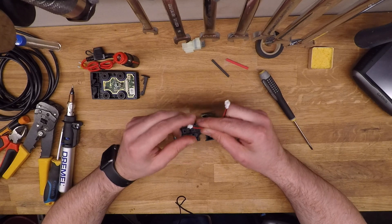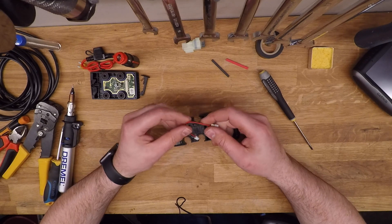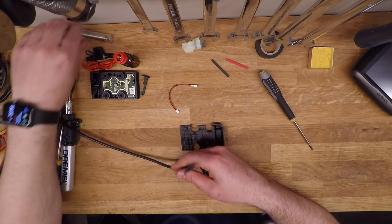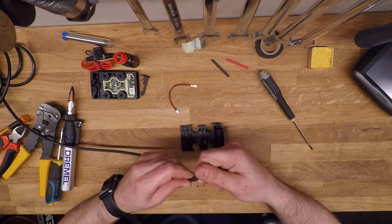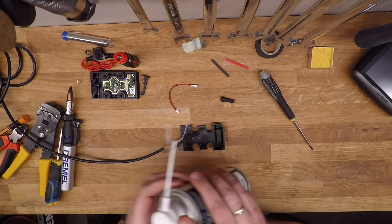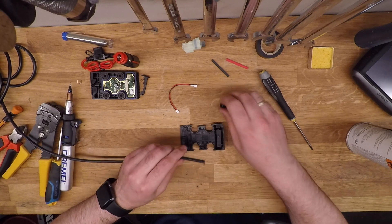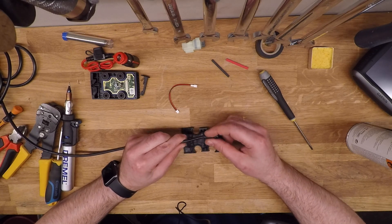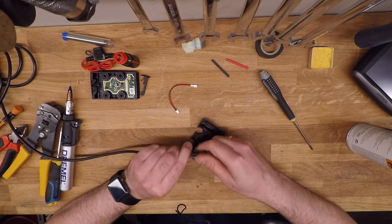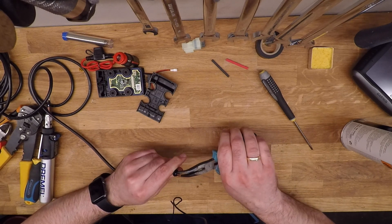If you have any residue of the silicone gasket, go ahead and peel that out. Next up you'll need a connector — I'll put a link in the description below. It's a fairly standard connector in the RC community so it shouldn't be too hard to get. Also have one of those flexible cable glands to put on the cable. In order to get the gland onto the cable, I have a 5mm very flexible silicone cable here with two wires inside. I use a bit of silicone spray just to lube it up to get the gland to mount over it, and then just pull that through. It's a really tight squeeze but it's fairly weatherproof as well.